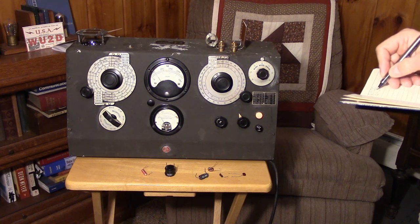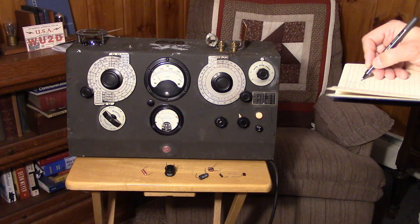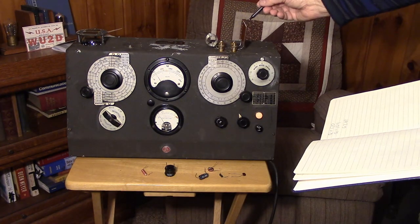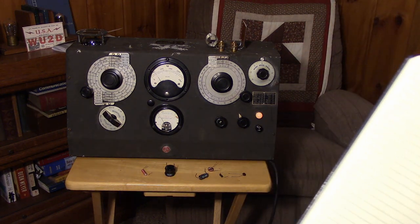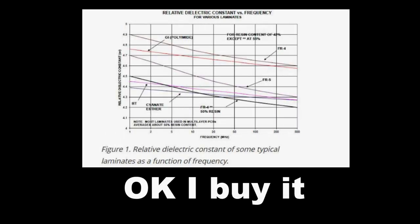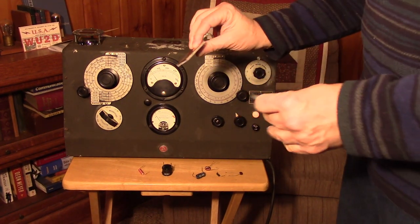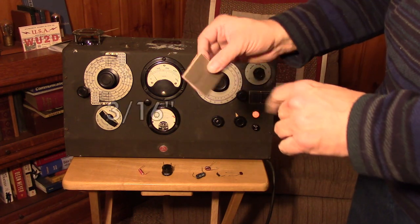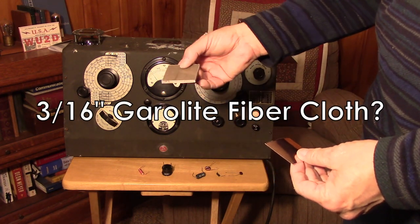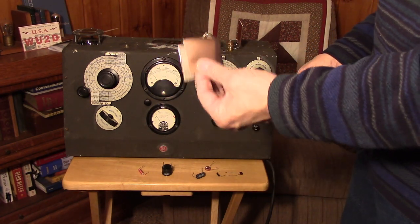Q equals 104, and the capacitance value is 62 picofarads. Using that data, we should be able to calculate the dielectric constant of the FR-4 board. The formula for dielectric constant is simply the dielectrically loaded capacitance value divided by the free-space capacitance value. It looks like if you adjust the amount of resin versus glass, you can make that look like we've got a good number. Next I've got this chunk of 3-sixteenths fiberglass board, used in a lot of military projects. I'm going to make a similar 2x2 capacitor out of that to determine the dielectric constant of this material.